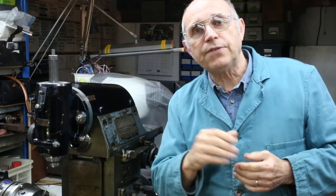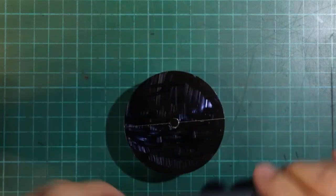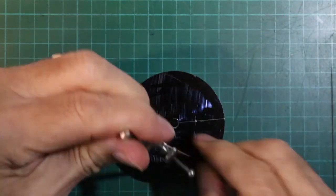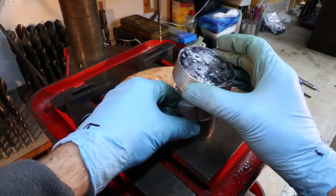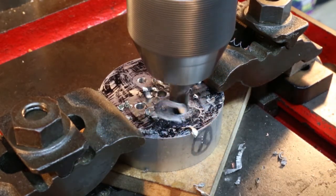We're getting close to the end of this video, but in the next video we're going to get our hands dirty. We're going to do some good old-fashioned marking out: apply ink to the surface of the metal, use a centre square to find the centre of the hub, mark with a scriber, measure with a rule, and use metal dividers to work out the position of a perpendicular centre line. With that behind us we'll be drilling, installing an alignment pin, transferring hole centres, and drilling counter-bores on the bench drill.